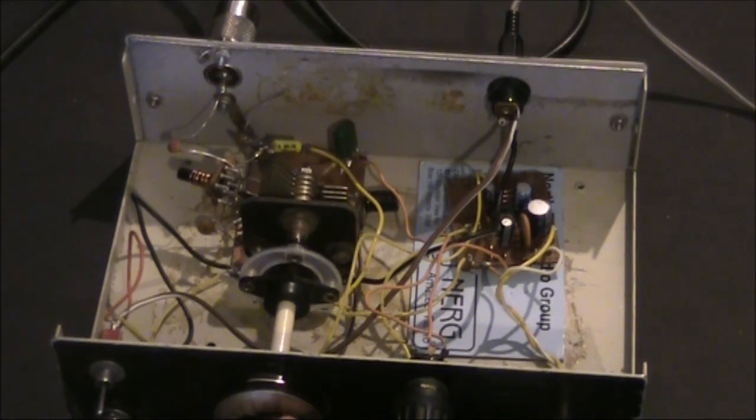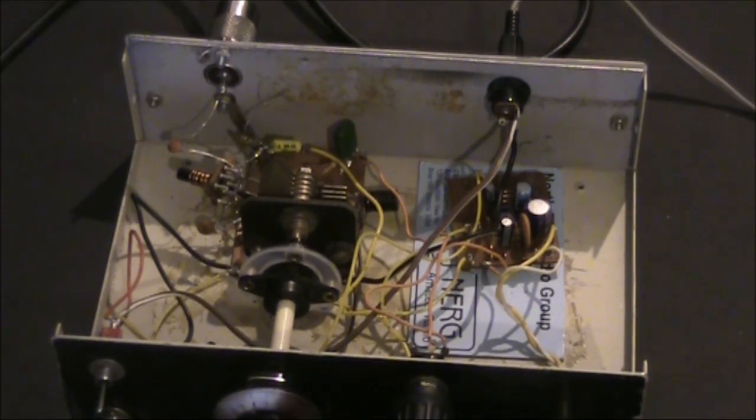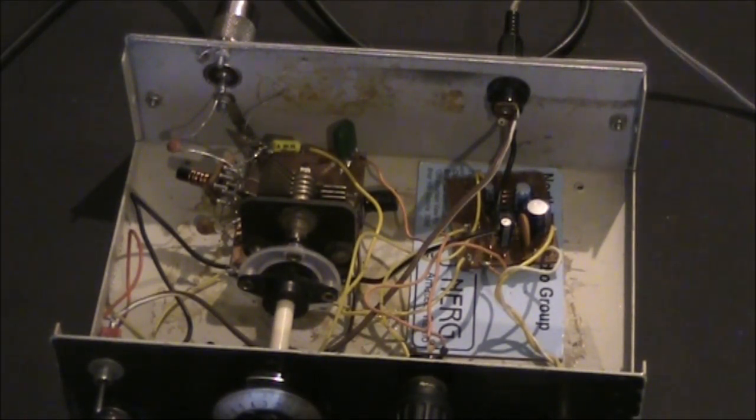There's a bit of interaction between the controls. That's probably about the loudest position here. There's quite a bit of interaction between the controls. I think it's probably best if you do build a receiver with several controls, because a lot of super-regen receivers — in fact most of them — don't have any type of adjustment at all. Often they work, but sometimes you might find the operating points are better where you can vary voltages. So it's probably better if you want to optimise things that you have several controls like this set does.